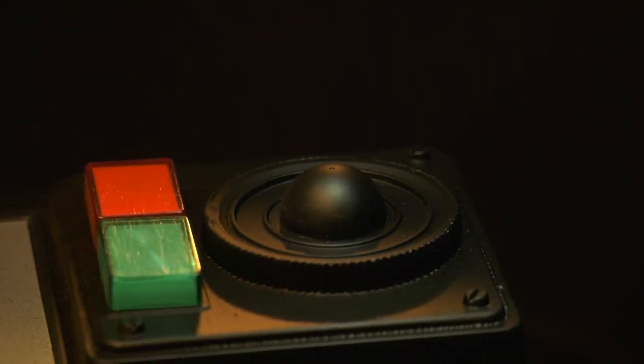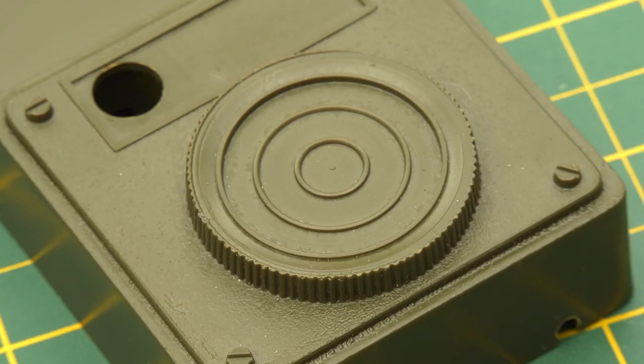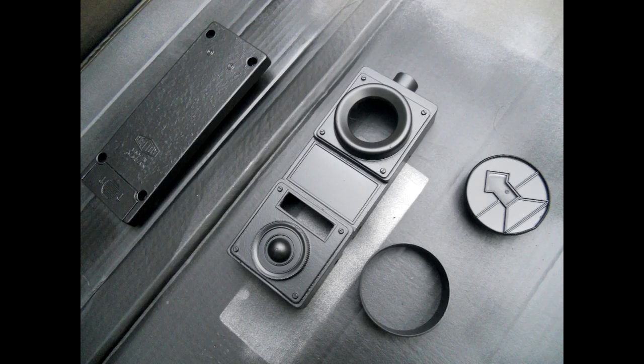The final plant-on detail at this stage lives right down at the bottom of the prop — a single 12mm diameter dome that sits smack bang in the centre of those concentric rings noted earlier in the general assembly graphic. Once I cemented that into position, it was time to start thinking about the painting. The first task was to prime all the parts, including those five loose EMA column wedges and the shroud elements, but not the green arrow segment or the 19mm end cap.